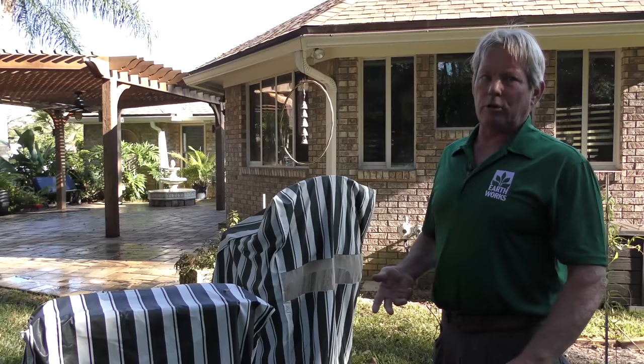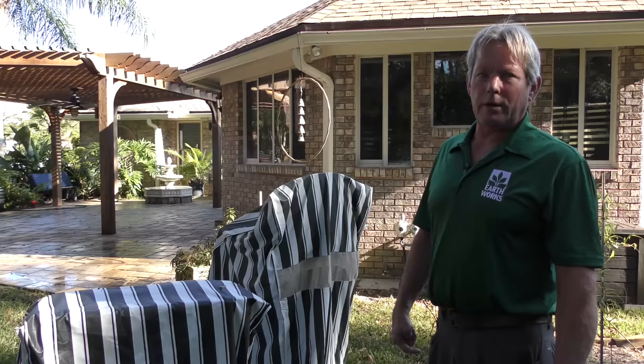This particular patio is just regular sweep sand, which will probably have to go back over in any light spots to fill in the sand. This usually has to happen before the sealant goes down — at least that's the way the homeowner likes it — because otherwise it's just sitting on the surface and could get washed away from the next rain or if they decide to wash off their patio.